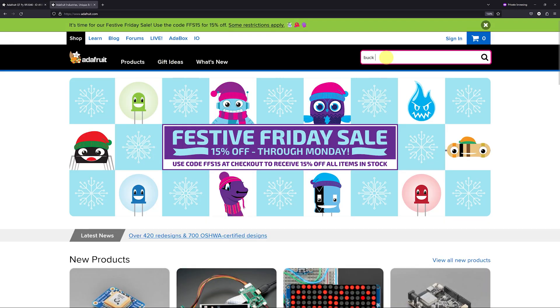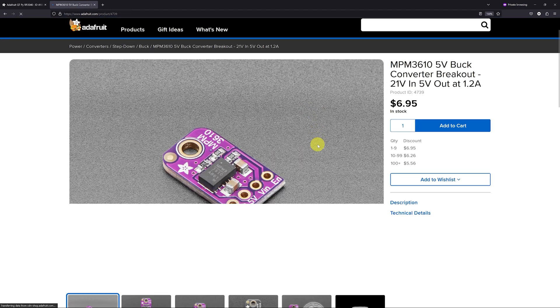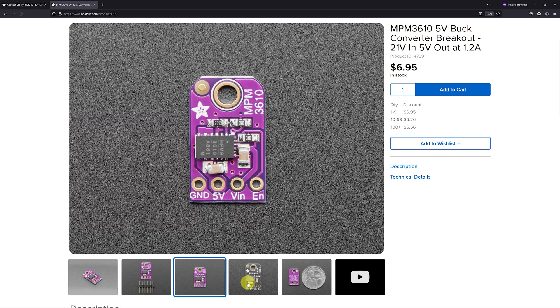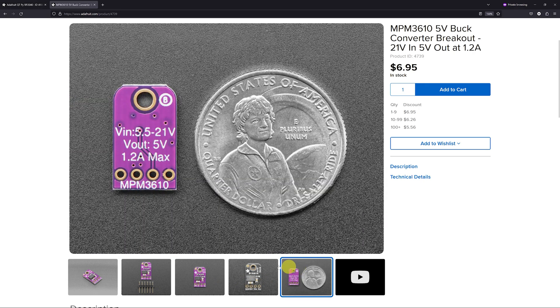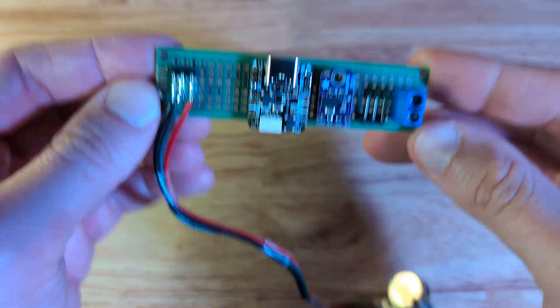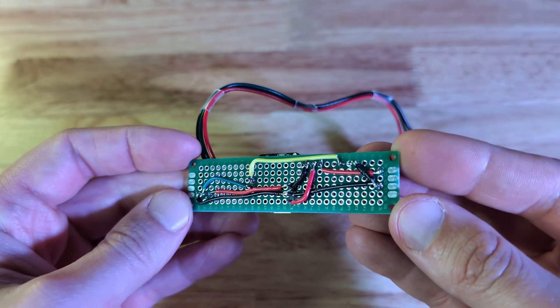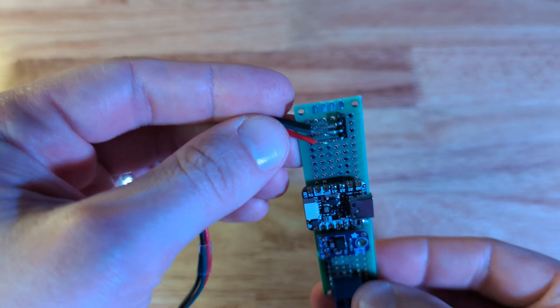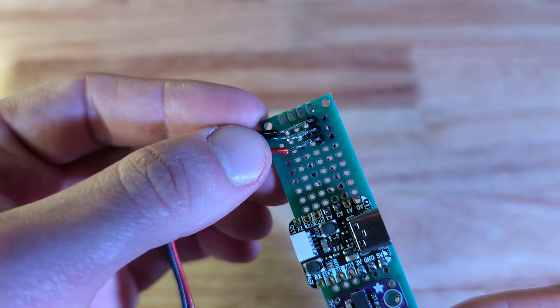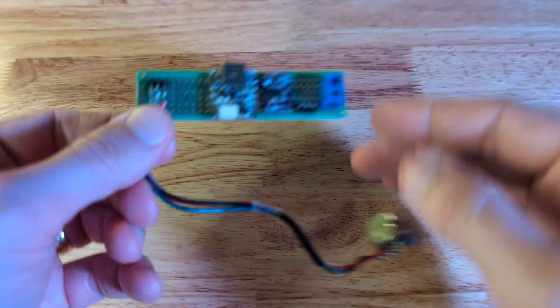The board runs off 5V, normally supplied by USB. I need to convert that down from the battery's 12V, so I'm using this little buck converter — it works with a wide range of input voltages and it's pretty compact too. Here I have assembled everything on a small perf board. It's not the prettiest, but it holds everything together and everyone should be able to build this at home with minimal tools. One day I might get into crimping my own connectors, but until then I have to live with soldering these cables directly onto the pins.